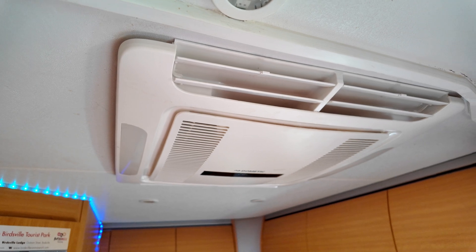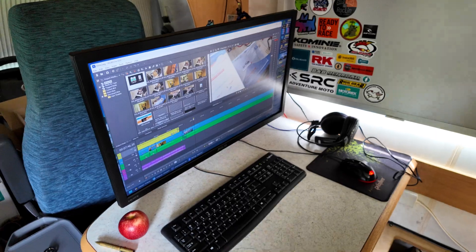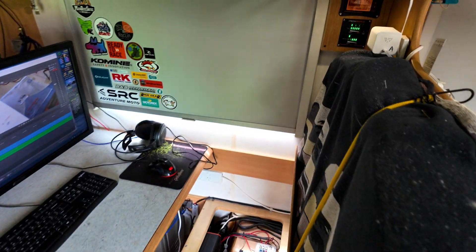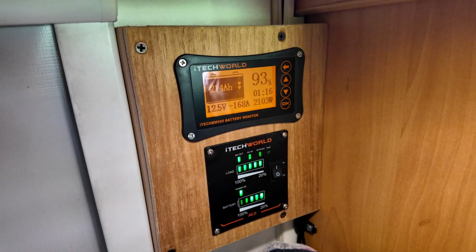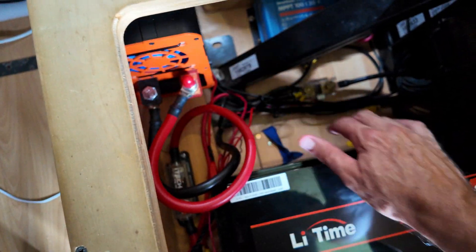The aircon is running - it takes a little while to crank up to full power. The AC is drawing just under 1,200 watts, and don't forget the computer is on as well. I tried the toaster, which draws about 800 watts, putting that on as well. That pretty much maxed out the inverter - we're looking at 2,100 watts now, 168 amps coming out. That's nowhere near what the battery can handle, nowhere near its 200 amp maximum capacity. It's not warm on the outside at all. Everything's hunky-dory. AC test passed - 2,000 watts, 160 amps, no problem.